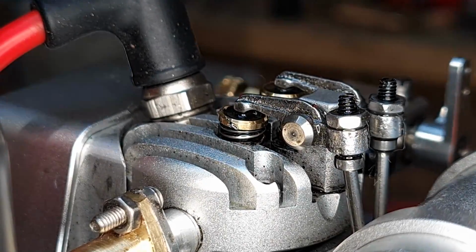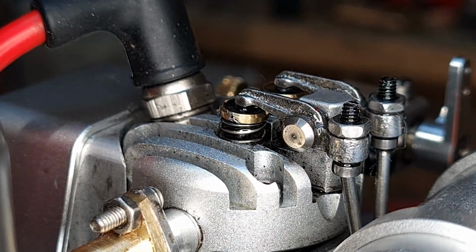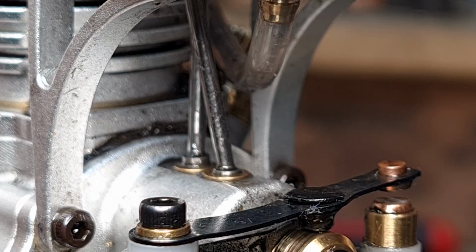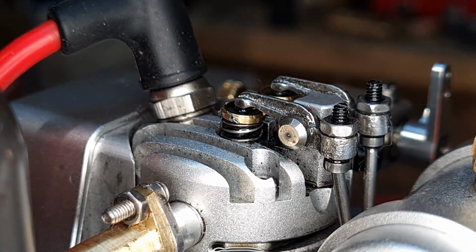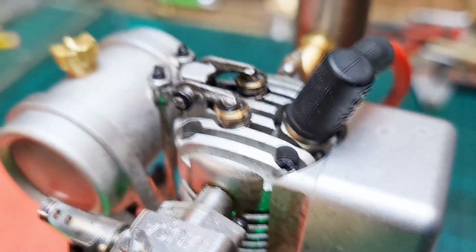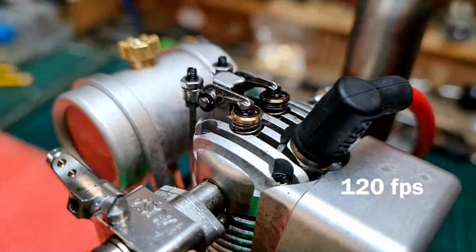The engine is a 4-stroke cycle with overhead valves and uses tiny push rods operated by a dual cam system within the engine block. These rods operate the valves in time with the rocker arms, and when the engine is running, the valves are just a blur as you can't see them at the high revs per minute, but you can see them operating when slowed down.